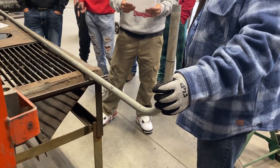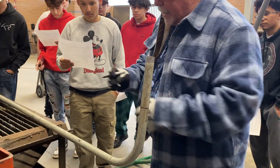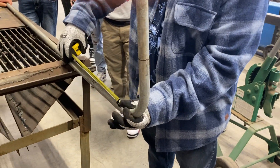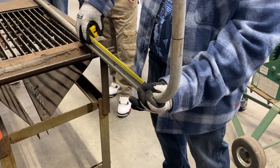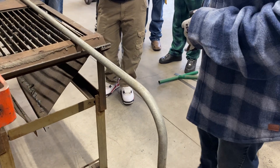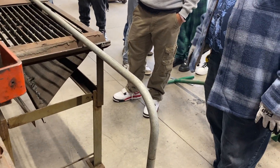This total distance of travel can be divided by 90 to give a multiplier for the distance traveled per degree of bend. We're going to do a little bit of math — I have seven and three-eighths inches, and we'll divide that by 90. We'll do this on a calculator when we get back in the building. Check it to see how accurate it is, and then we've got our answers.